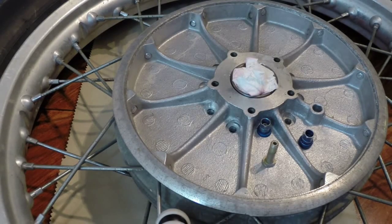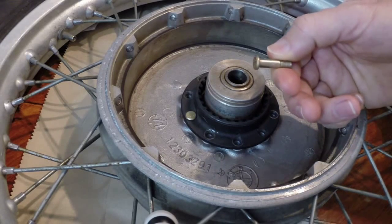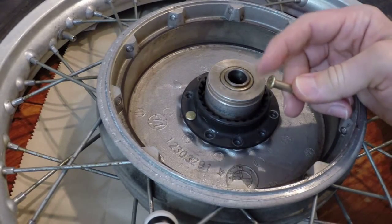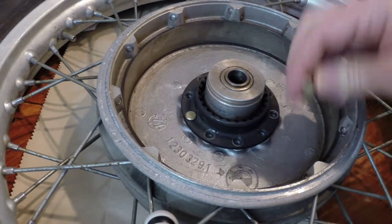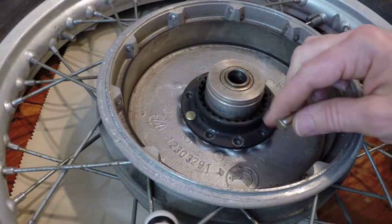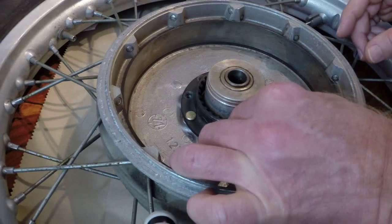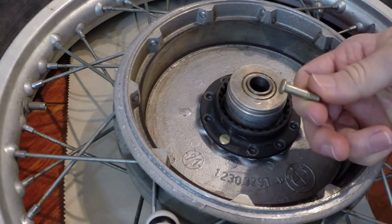The high lock pins I used are the protruding tension head pins — the largest head size in the high lock fastening system. Even with this head, there's plenty of room between the pin and the final drive for the slash five. However, because it has a protruding head, you do have to grind down one side due to the shape of the driving dog. It's not completely flat — the same applies to any bolt or nut. I ground down one side to make it flush against the housing of the driving dog. These high lock pins are close-tolerance; I measured them with my caliper and they were almost the exact same diameter as the close-tolerance aircraft bolts I was originally going to use.